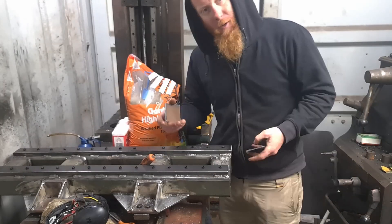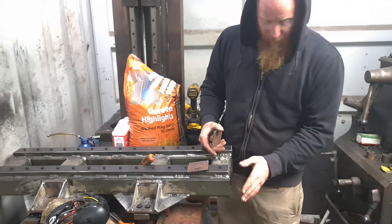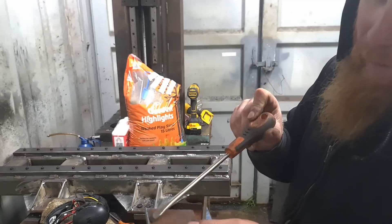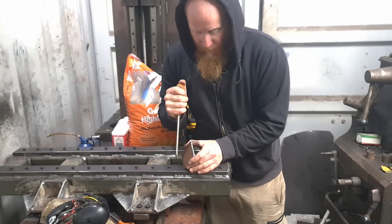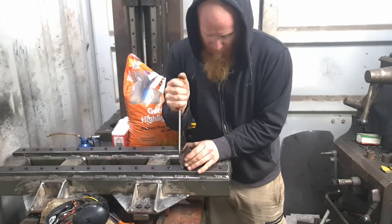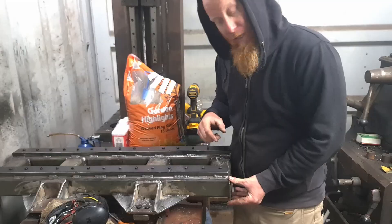So before I can fill the ends, I'm going to tack these caps on just so that nothing comes out of the other end, and then I'll just take them off later on. Hopefully I'll have a nicer look at the ends — if not, we'll cap both ends. There's a bit of slag from the plasma cutting — that's pretty easy to get off. That old saying: anything's a hammer if you hit it hard enough. The screwdriver works well — tap it off, gets it off quite nice, good enough to weld the pieces on the end here.